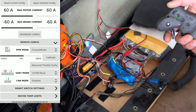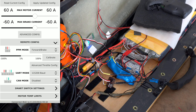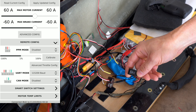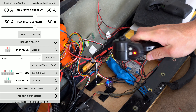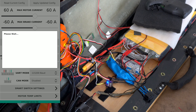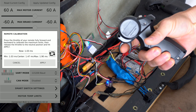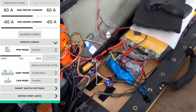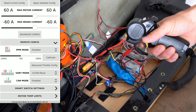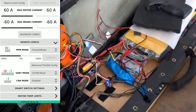So if I want to switch to the other one, I'm going to turn this off and come back to disable it, that way nothing goes crazy while I'm trying to calibrate the other remote. Now I'm going to switch over to number two, which would be my mini remote. Let's turn this on — we can see the red light. We'll come over here into calibrate, reset, full signal, full brake, apply. You can see we're zeroed out, full signal, full brake. Full throttle, full brake — great.